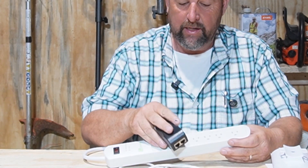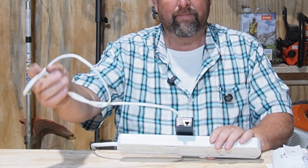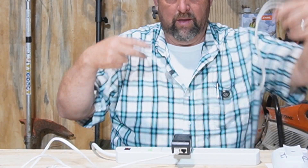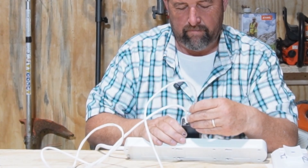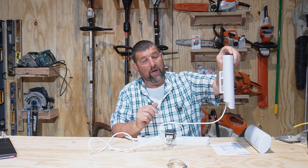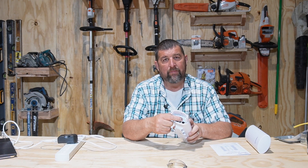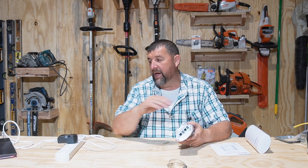This is a PoE power injector. You'll plug it in, then come in here on the PoE side and plug this in. One side will go to your internet, and the other side will snap into this — and then you've got power. This black button right here is how you change the channel and set it to what you want your signal to be. There's a number inside with an A and B on this little plug. There are 16 channels you can choose from — 0 to 9 and A to F — and the current channel number will be displayed on the digital readout. Underneath is a tiny switch for A or B depending on which one you're using in your configuration.